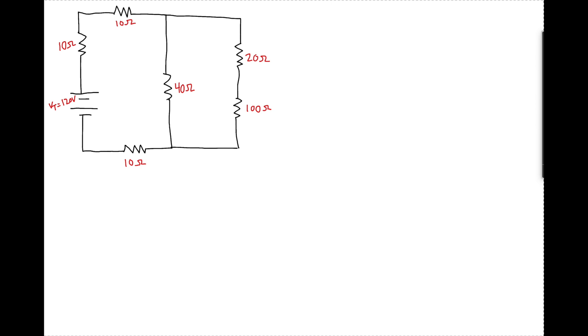The first thing I'm going to do to break this circuit down is look at these two resistors right here. These two resistors, regardless of what's going on over here, are in series. We remember that resistors in series are just the sum: R1 plus R2. So if I take these two and simplify them into one equivalent resistance, that is going to be 120 ohms.